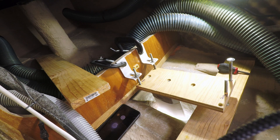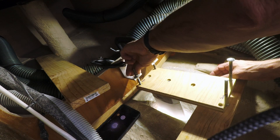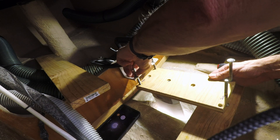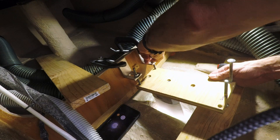I could see the phone on the lower left corner of the screen as I performed the adjustment. I kept adjusting the three screws until the stern tube bore was aligned with the strut bore. This took several iterations, but eventually I got it reasonably well aligned.